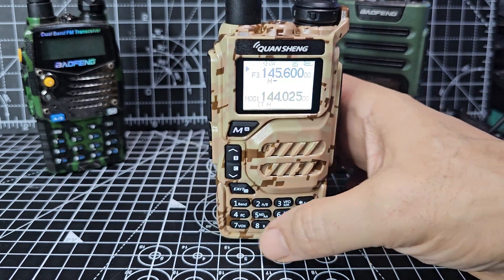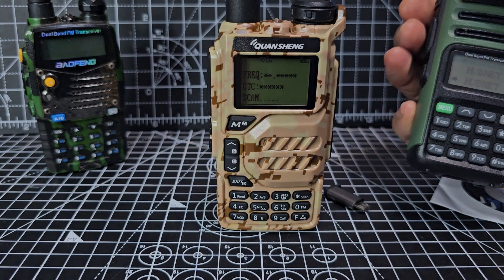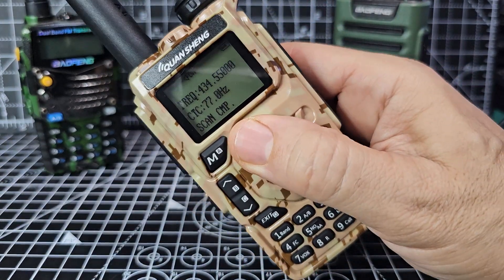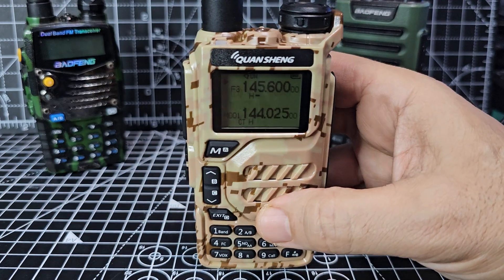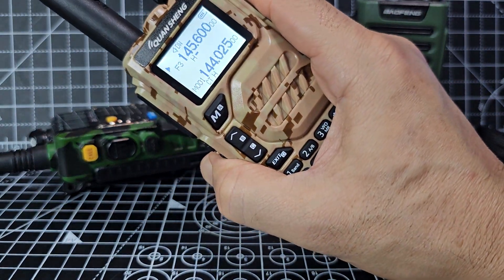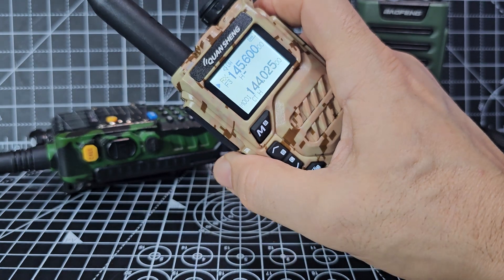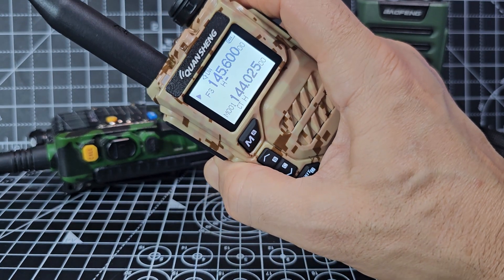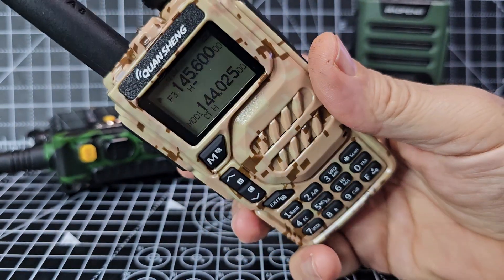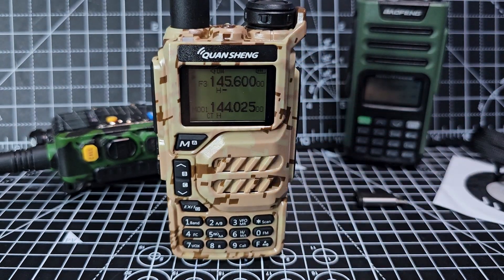Let's try some of the other buttons, then we'll end the video. Press F then F again for scanning. The way that works is if I turn on a different radio and key it, it should pick it up — and it did! 434.550, CTCSS 77. So that's your frequency scanning. If you hold down one of the buttons at the bottom — press it once: torch; flashing is your squelch off basically. And there's an alarm sound. I think it looks fantastic — do I need it? Definitely not. Do I enjoy it and will I have fun with it for a few pounds? 100%. Thanks for watching, 73, all the best.